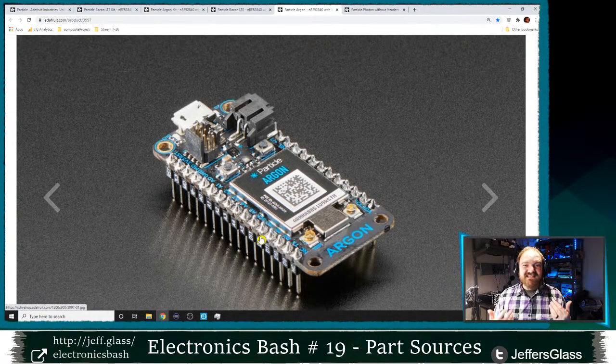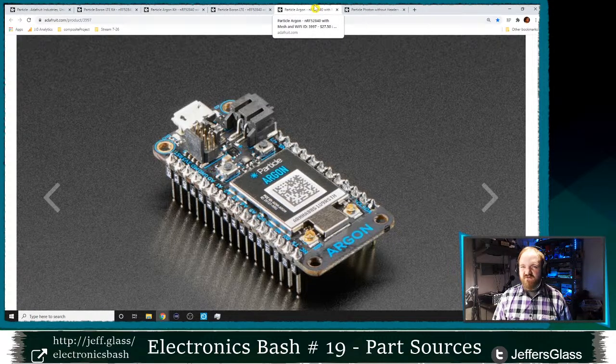It's a cool idea. They're not quite there with the implementation yet. The mesh networking is actually not as generative as you want it to be. You kind of have to do a fairly defined mesh setup, and it's not super duper flexible. They also want to tie you into their ecosystem of messaging. So your messages from your Argon, say, go back to their servers and then head to yours. You can't really configure the messages to go directly from one of these endpoint devices to an arbitrary server or device on the internet.